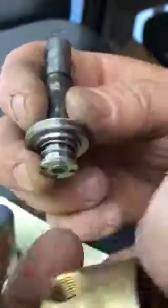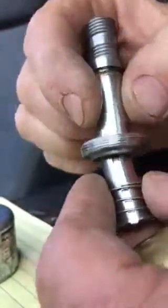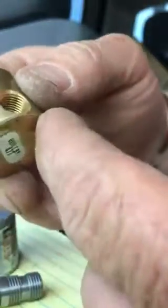Pretty simple. So what I like to do is, first off, I want to take this off and blow through it. If you can blow through it, then we know that this is good, that orifice isn't plugged. The next thing we want to do is reattach fresh water to number 2. There will be a fitting here, and see if you can blow through here. Okay, if you're still having a problem, we need to concentrate on this number 1 orifice, which is the center hole.